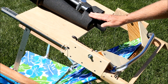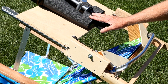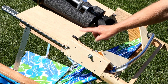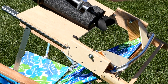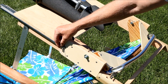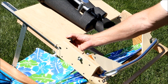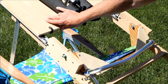I used a 25x100 millimeter binocular. You could build these chairs with smaller binoculars and it would work even better. For this setup, I required 12.5 pounds of counterweight located about two feet from the pivot point. The half-inch board on which the binoculars are mounted sits on a pair of linear bearings — the kind used for kitchen cabinets — allowing it to slide forward and back. I have a string mounted so that if the cradle ever falls forward, the binoculars won't slide off and break. I've also added a bungee strap that takes up about half the weight of the binoculars, making it much easier to slide them forward and backward when you're in the chair.